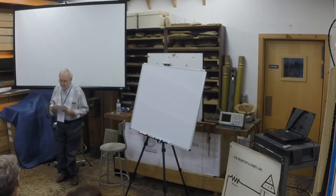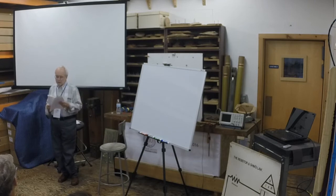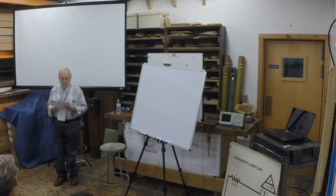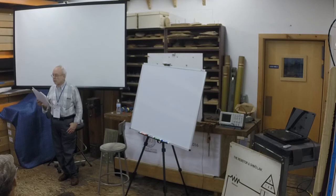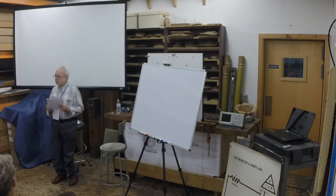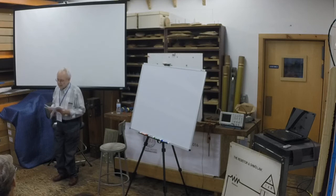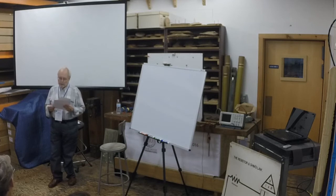getting back to the parallel between electricity and plumbing, a battery can be likened to a water pump. Water goes in one end and gets pushed out the other, making a complete circuit if the water goes back to the intake. Ben Franklin knew that electricity acted in much the same way. It wanted to get from one terminal of a battery to the other. He reasoned that there was an abundance of electricity at the former and an absence at the latter. So he called the one positive and the other negative, assuming that electricity, whatever it was, flowed from the abundant positive to the depleted negative.